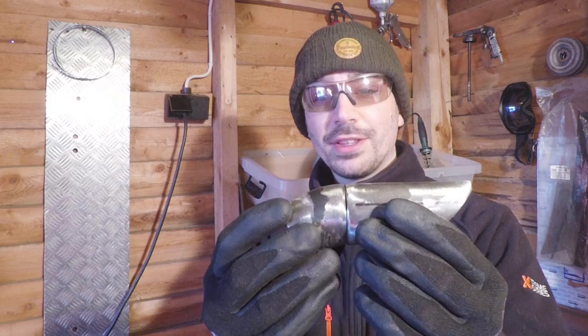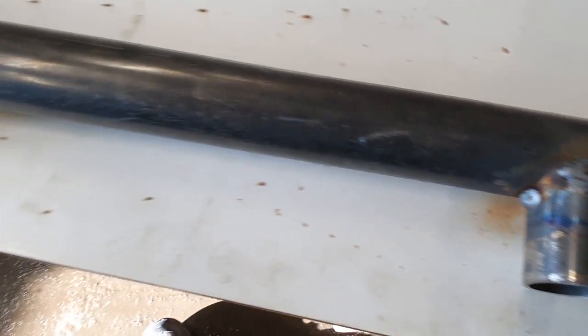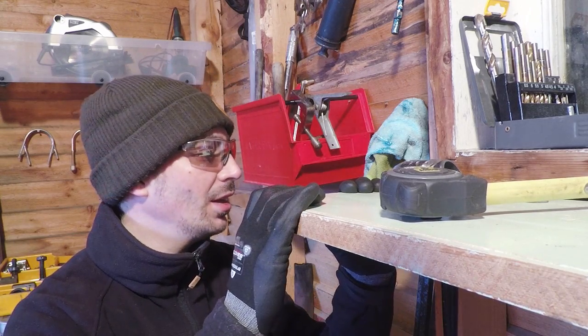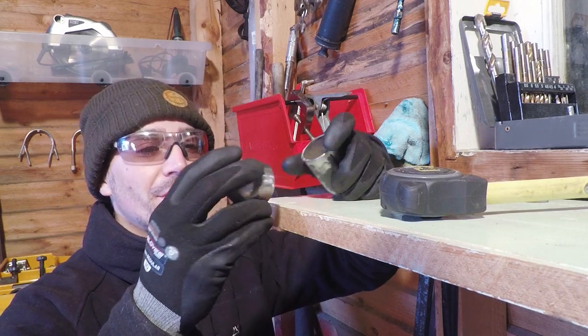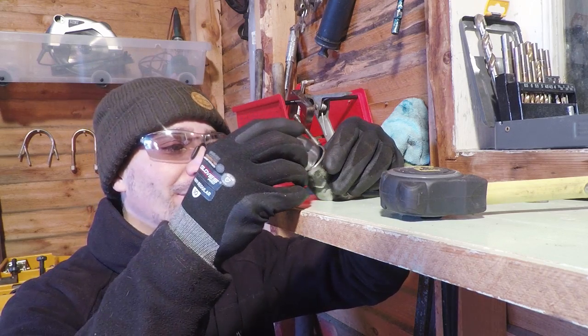Just got all these cleaned up and ready for weld, and obviously rounded the edges off as you can see there, so when you weld, the weld is going to penetrate a bit better and you'll get a better bite on that - it'll be more structural. This is the pro table workbench, retails for about £99.95, really good bit of equipment. I'll put the link in the description if you're interested.